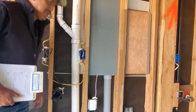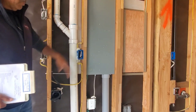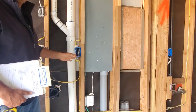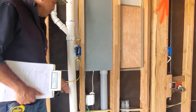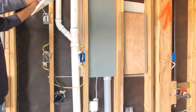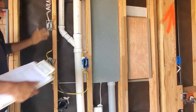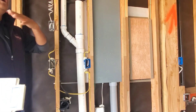This is an interior clean out. We used to plumb clean outs to the outside, but because of updated PG&E safety codes, we're no longer allowed to plumb any water near electric or gas, so we turned it to the inside of the garage. The two wires wrapped on the hose bib over in the back — this is where your irrigation timer will be; it will plug into this outlet.